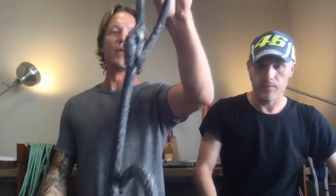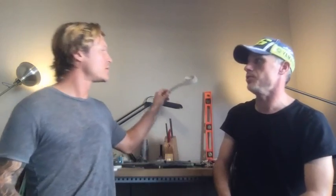Like this one? Yeah. Actually, the splice is totally different. It's a much easier splice to do. With a core dependent eye splice, the reason it's called core dependent is because the cover is actually part of the strength of the rope. With this, the Dyneema chafe sleeve does not add to the strength at all. It is there only for UV and chafe protection. You're not relying on the strength of this cover. The splice on this is not as difficult to do.